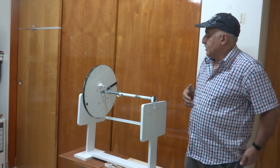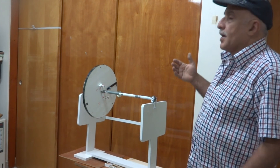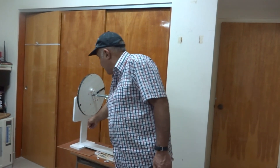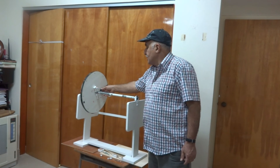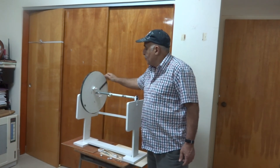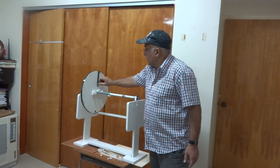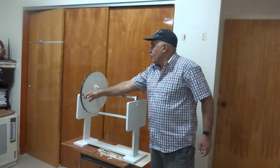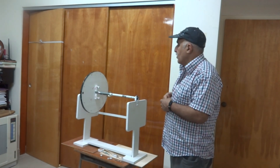So now it is balanced. This is all about static balancing. In case of static balancing, you can find the heaviest part — that part which is more heavy will come down side. Then you fix weight opposite to that. I have removed the weight and now this part is heavy, so it is coming down. If I move it here, again it will come down. So I will fix weight opposite to this one, here. Now I bring it to this position — it is not coming down. Because before it was heavy on this side, now it is the same weight on this side and this side. So this is called static balancing.